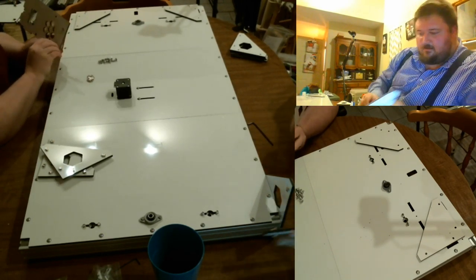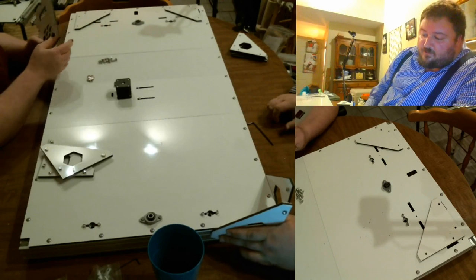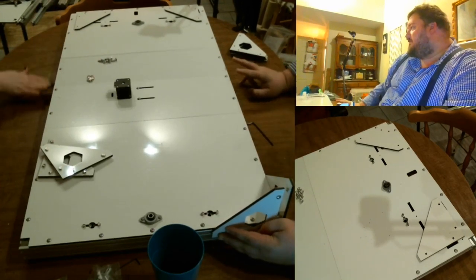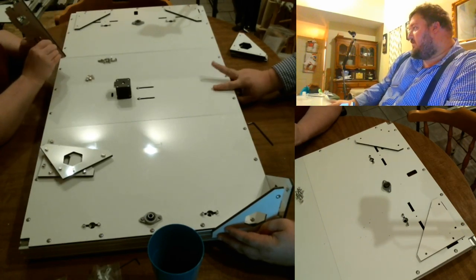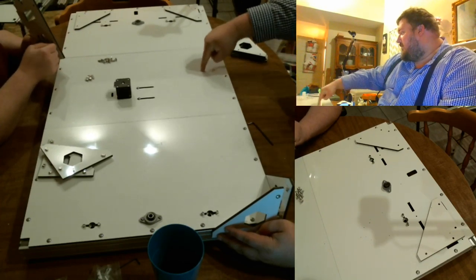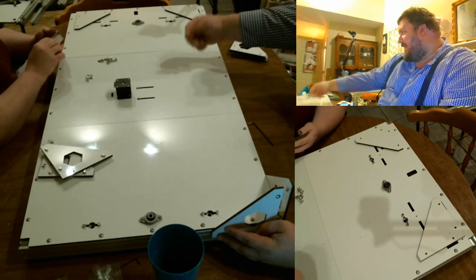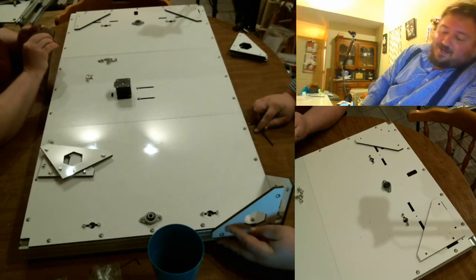Does this just use regular filament? Yeah, regular. Well, it can also use specialty filaments. Remember how I told you I was wanting to get a printer that can do dual filament? This one does two at one time. It's got one extruder, but two feeds into it, so it can switch. It can stop feeding one and start feeding the other. It'll do a layer, then move over and do a sacrificial little square to switch colors, because as it's doing the square, it's gradually changing as it's cleaning out the nozzle from the last color. That's called a sacrificial tower, the color change tower.